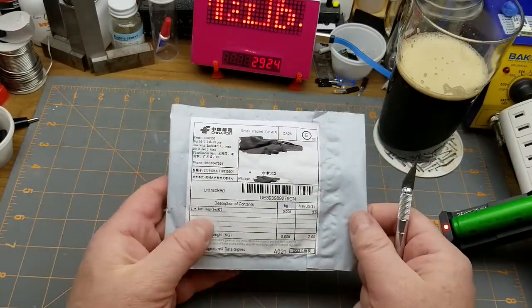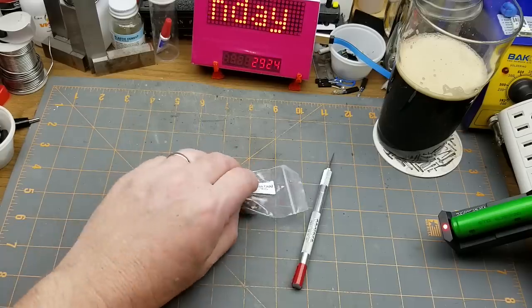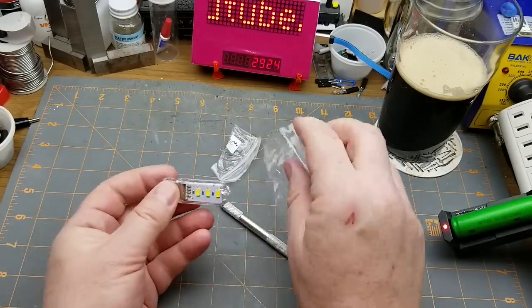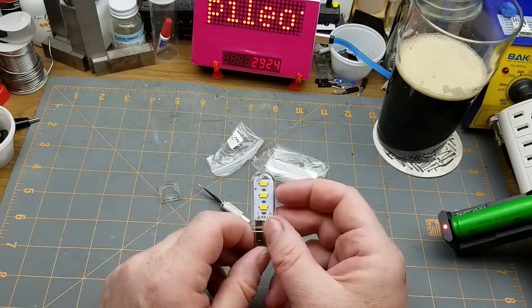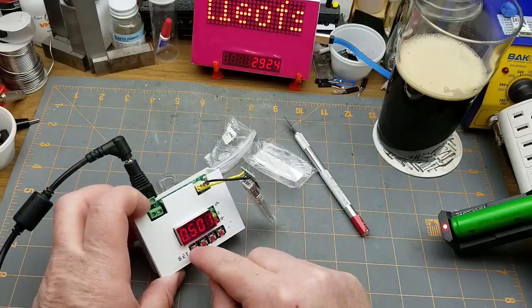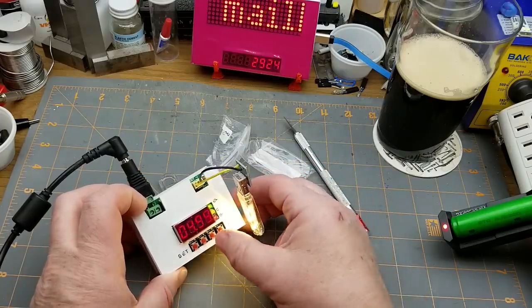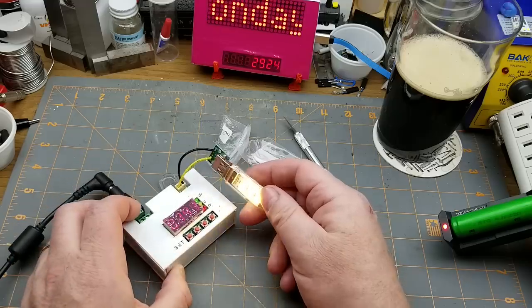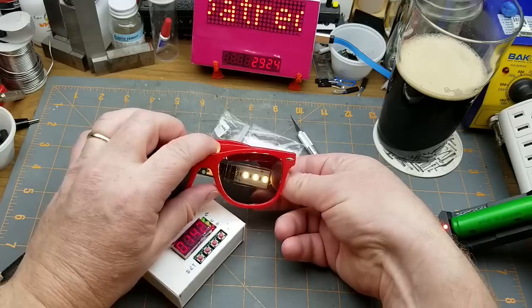And the fifth thing: LED lamp. More LED — I like LEDs. Just a nice, simple, little USB 3-LED unit. I've got my power supply set for 5 volts and 500 milliamps. Turn it on. To me, that looks warm white, and it's drawing 141 milliamps. Wow, that's quite a bit. And that is blindingly bright. Let's dim it down a little bit — still pretty bright, actually.